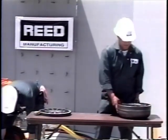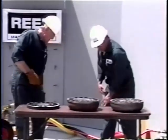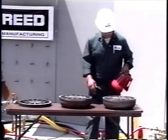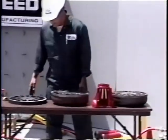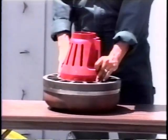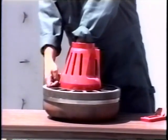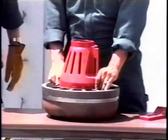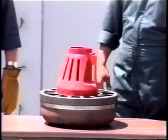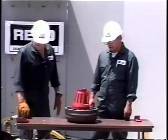Now we're going to get into some more specialty feed wheels. The first is the 15LA, which is good for high rock concentration. There's a rock cone used with this, inserted in the machine to divert all the material to the outer pockets. The air comes down through the inner pocket and just pushes the material up and out, so it's not going through the U-pattern. A very high rock-concentrated mix — 50% rock or even 100% rock — can be conveyed using the LA system. Air consumption is between 650 to 750 CFM, with 6 to 9 cubic yards per hour.